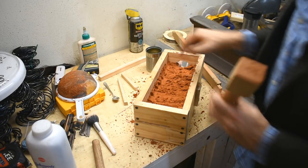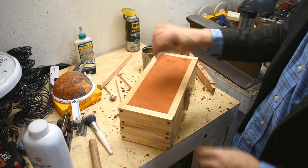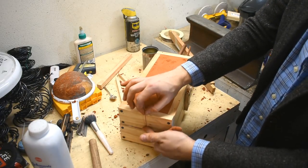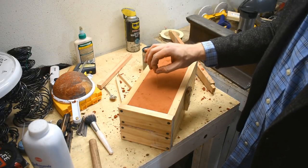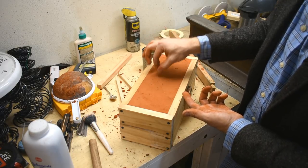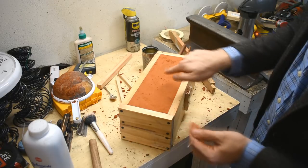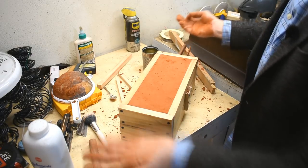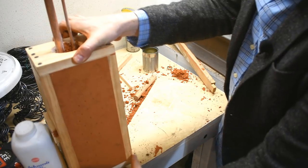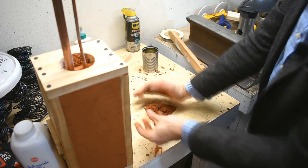This is going to be really interesting with this big hole on the top. Before I forget — I have a piece of steel TIG welding filler rod here. This is what I used before to vent. I put a bunch of little holes through it, hold it next to the edge of the flask to see how deep it should go, then poke holes into it so air can vent. Petrobond is pretty good at venting to begin with, and this really isn't going to have any areas where there's metal trapped, because the metal will flow in through the little hole and bubble up the big thing as air escapes out the top. Sure is nice having a lighter flask that I can actually pick up without grunting.